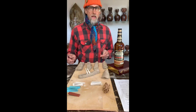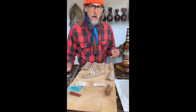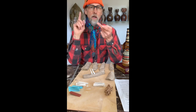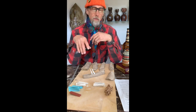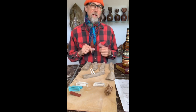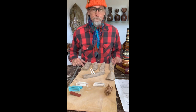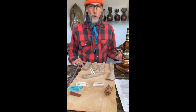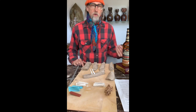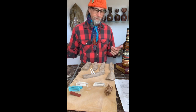All right, I'm going to discuss making cone packs. The first thing to think about is the type of clay you use, and you could use a really high or refractory clay. In this case, I'm using fire clay, some alumina hydrate, almost 50-50, and some sawdust. I use sawdust or vermiculite, and you can wedge that in and it helps you from having any problems with moisture escaping that cone pack. Preferably, although people forget all the time, you should make your cone packs a couple days in advance so they really dry when they go in the kiln. But if you forget, sometimes vermiculite or sawdust helps it wick out during the smoking or the candling of a kiln, okay? So, something to think about.